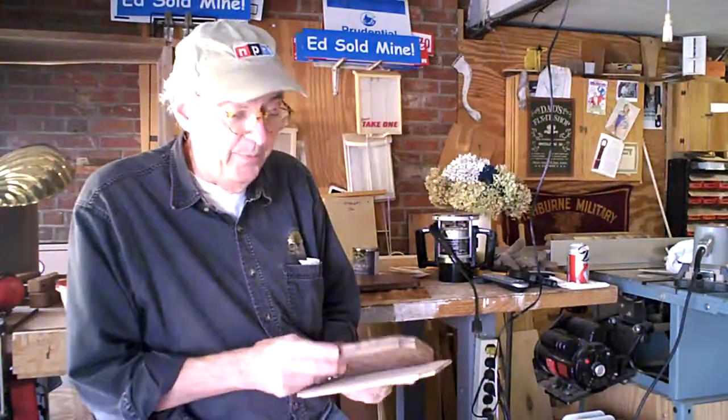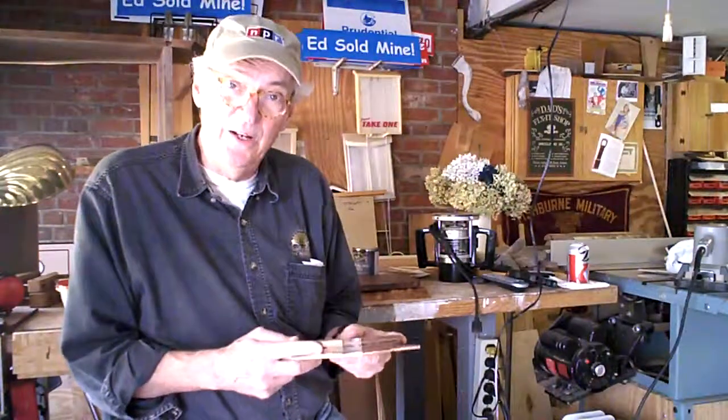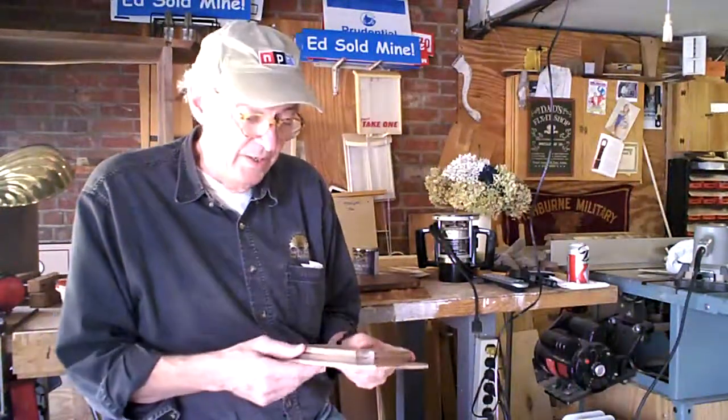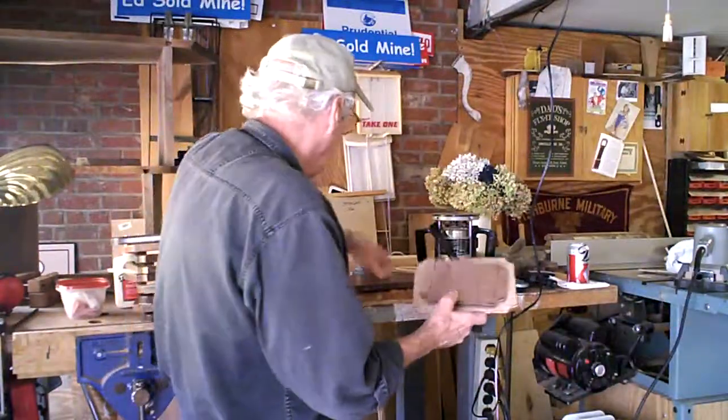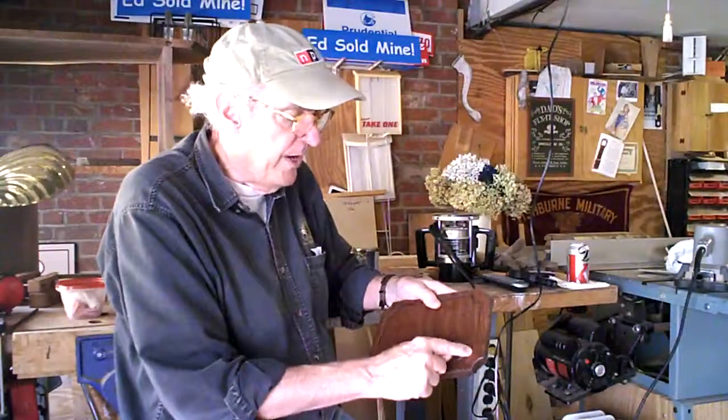So anyway, the way I did this template for the router cut, I just double stick taped it down. Be careful, don't put too many pieces of tape. I put 3 all the way across the back, and darn near couldn't get the template off the first one I cut. So I cut that down to 1 piece, and that was hard enough to get off. So we got that down, and by golly, here comes the route, just like it was in the magazine.